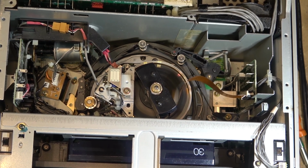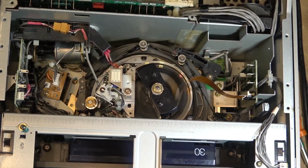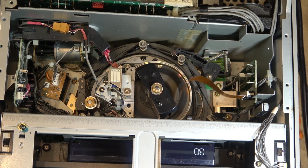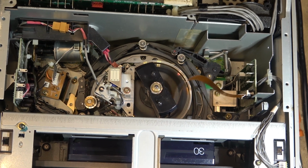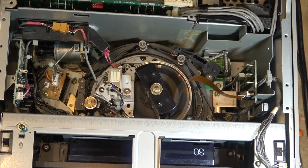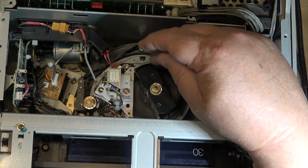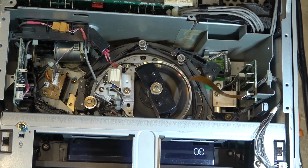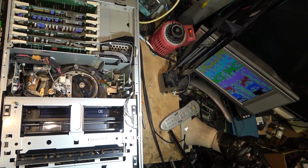Just not detecting it's an SX tape again, because this should be spinning a lot faster than it is. As soon as I went into jog mode, it sped up the drum, because the drum runs much faster. A little quieter now than it was before, that's for sure. Still no picture, just kind of half-assed color bars. I forget how many minutes of color bars.